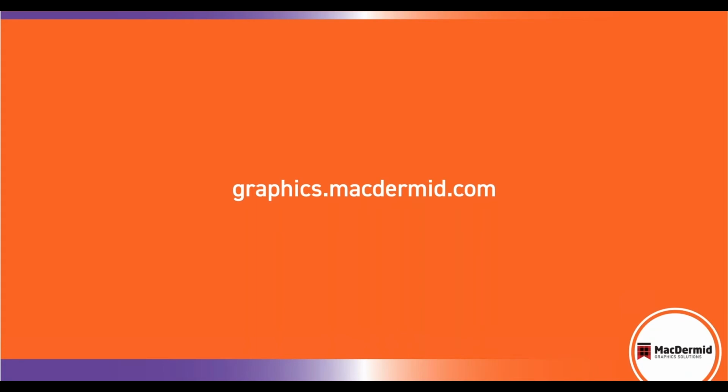Okay. How about UV LED exposure? Is this a qualified plate for that, or is that in the works? Good question. It is currently in the works. We are working on getting the XPS certifications currently for the 112 and the 125 plates, which we feel will be most applicable to the use of the UV LEDs.